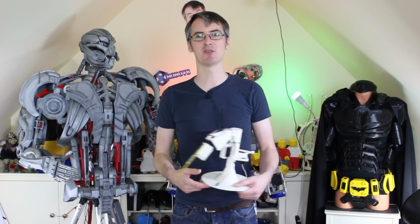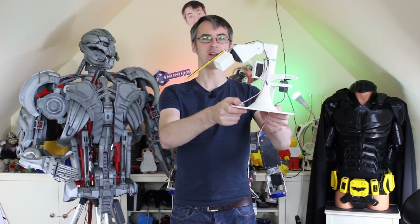So although there are details which will get worked out through the build, the nitty-gritty detail of how the joints and the bearings and those things hang together, the main thing I need to be really careful of is that I can actually work out the mathematical model, and that's what needs planning. So we need to talk about a kinematic model and an inverse kinematic model, and I'm going to demonstrate that with this robot arm I made for another project.